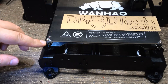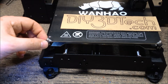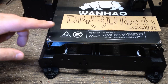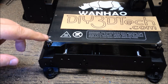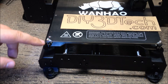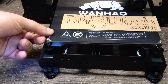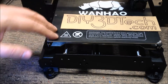I printed these out of PLA. I probably should have printed the spring spacers out of ABS or PETG instead of PLA, because this is a heated bed and it is up against a heated surface. I typically don't get this hotter than about 80 degrees C, and it's going to take about double that to actually melt this — however, I'm sure this will soften it. So I am going to recommend, when I put these up on Thingiverse, that you use ABS or PETG — something that takes the heat. If nothing else, I'll just print a new set and put them on.